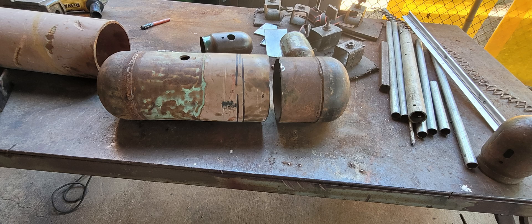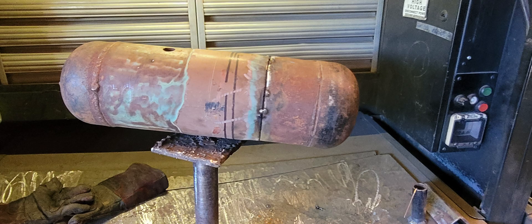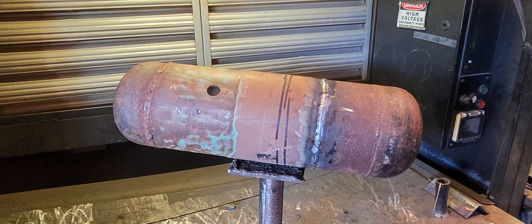Then I had to design this crucible — this is where the oil is gonna go and get heated, then become a vapor, and when it's a vapor it'll go into this big column. For the crucible I just made it out of two pipes. I was lucky enough to find pipes that had end caps already on them. It ended up looking like a giant pill — a giant Xanax pill or something. Lined it all up together; it wasn't completely straight, but I didn't expect it to be.